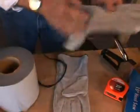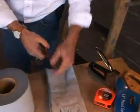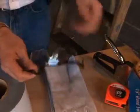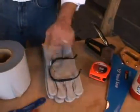Along with that, you'll need long cuff safety gloves. These are insulated, and you'll need them as you will be working around open flame. If you do not wear a glove, you'll never have to shave your hand again. Along with that, safety glasses. Occasionally you get a blowback of flame, and you want to make sure nothing happens to your vision.